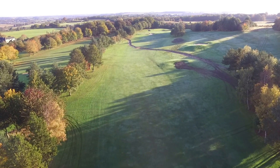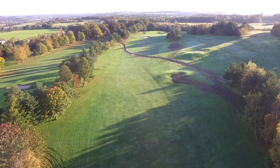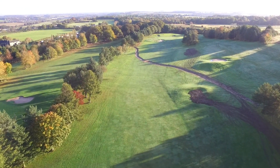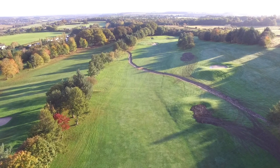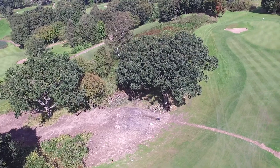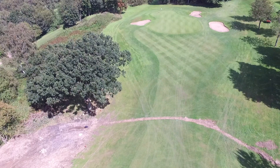Using those survey results in conjunction with physical site investigations, we've then come up with a design of a new arterial drainage system. An arterial drainage plan is the heartbeat of a drainage network, very much in the same way as a motorway system works before branching off into the A and the B roads. The foundations of a really good arterial system provides outfall for future primary and secondary drainage, designed to remove standing water quickly.